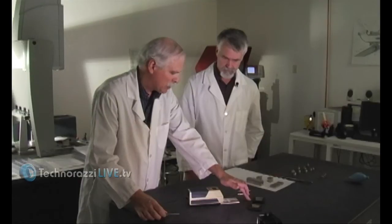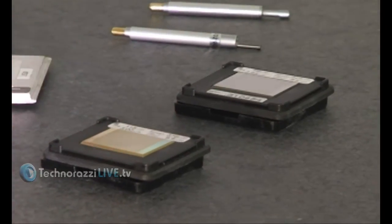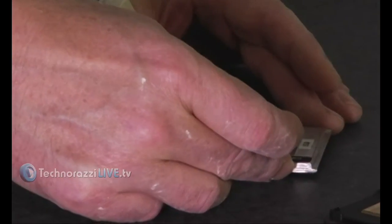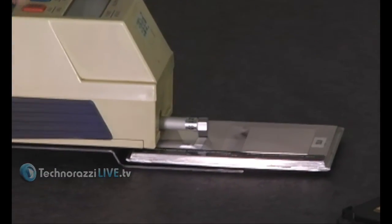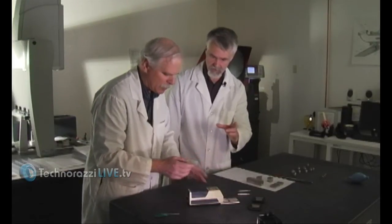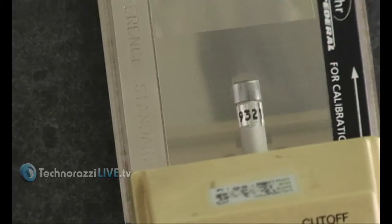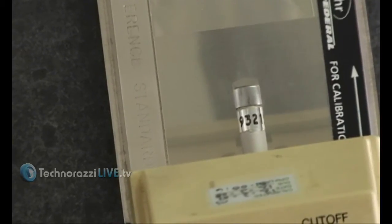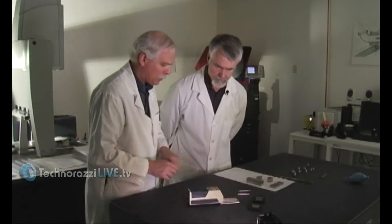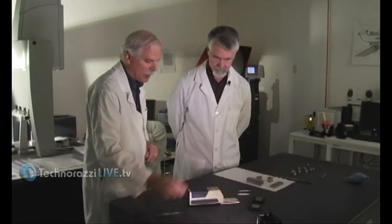Most units come with single-patch standards. They're sent to the calibration lab as well, and a lot of times they'll be different than what they're marked. We'll do this several times until we get the maximum reading — that will be our basis. You rotate it slightly in each direction to find where the maximum reading comes from. The highest number will be the true RA number. Any time you change probes, you have to reset the gain — that's not a defect, just different probes have different impedance. Now we're set at 117 and ready for use.